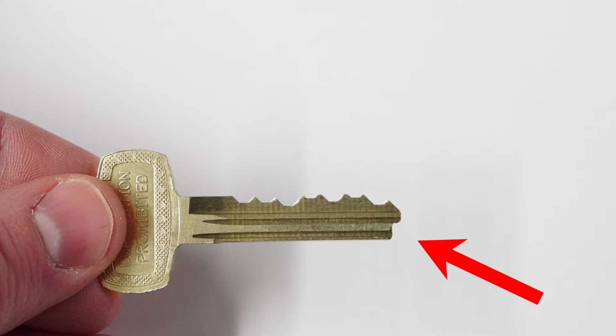All right, now that's really important because when you pin up the cylinders, you need to be paying attention to that. If you are right-handed, typically when you're pinning up the core, it's not that hard because the way you're reading it and the way you're looking at the core when it's in your right hand is somewhat simple to understand. But if you're left-handed, it can be kind of tricky, and it can be kind of tricky if you are used to pinning up other types of locks, because typically when you read the code, 1, 2, 3, 4, 5, 6, it's going to start at the shoulder and go to the tip of the key.